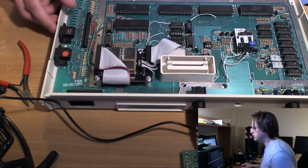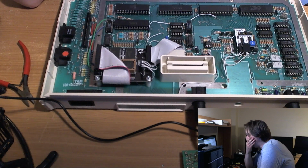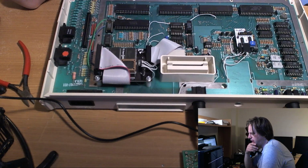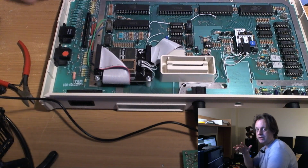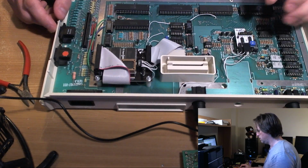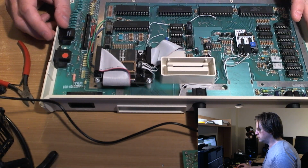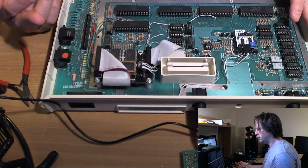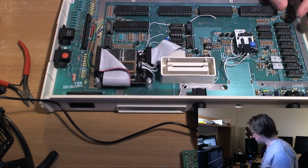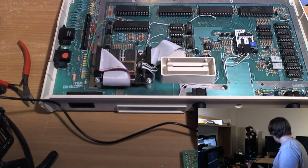Yeah, if you can find it, there are 2 different models of this monitor, M227WD. Now the other one, what's the other model number? It's got a suffix after it. M227W. It's either a WP or a WD something, and that doesn't have S-video on it at all. They dropped S-video, which makes the thing, well, to me, next to useless. So this one has got the S-video input on it, and it's a full HD monitor. It's obviously got DVI, VGA. I raved on about it on the Atari Age forum a few years ago when I first bought it, and it's absolutely superb, so versatile.